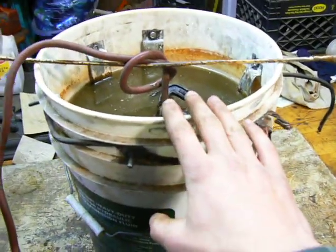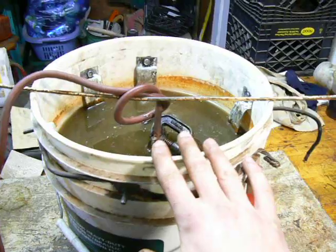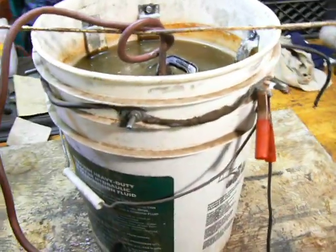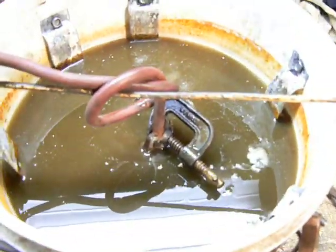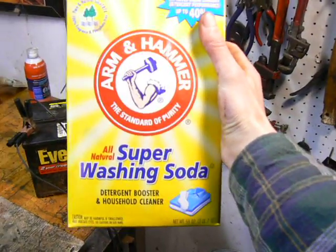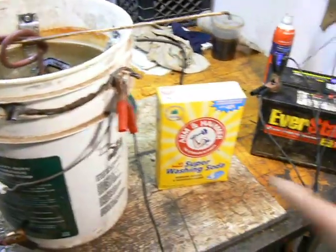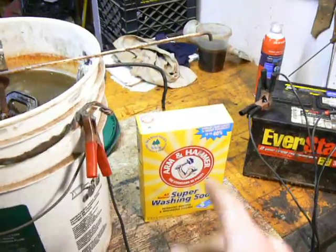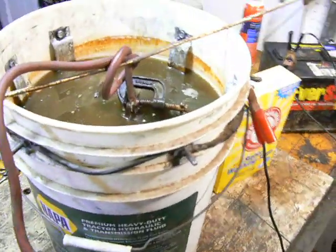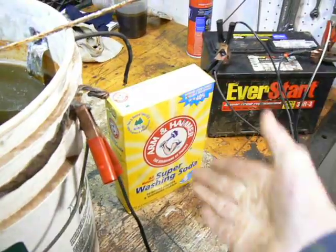Then from the battery, I go to my electrolysis tank, which I made out of a five-gallon bucket. If you have really big parts that you need to de-rust, you could even use a watering tank for horses — one of those big plastic watering tanks. In it, I have water mixed with washing soda. I have it back here — Arm & Hammer Super Washing Soda. You can also use baking soda, which is sodium bicarbonate. This is something else; I forget what the chemical name is. I believe it increases the electrical conductivity of the water. I got that for like $2.50 or something.